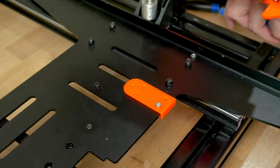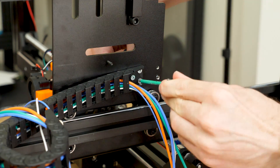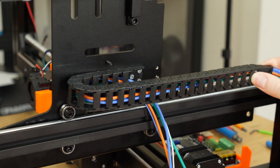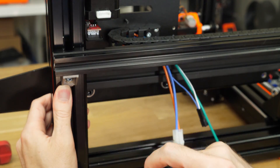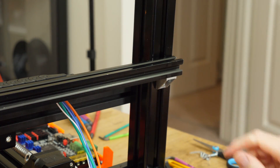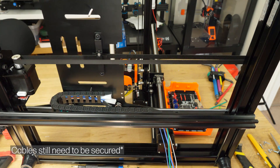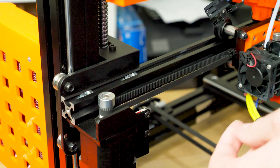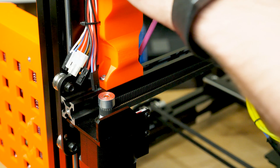The old drag chain was mounted using only a single screw, but I need more than that. So I'm adding three screws for the drag chain itself and a second mounting point next to the original cable in order to have a cable tie to hold the cables secure. For the X carriage, it doesn't need to move all the way to the end of the extrusion — I can just mount the drag chain with a 3D printed part using T-nuts into the top of the extrusion.